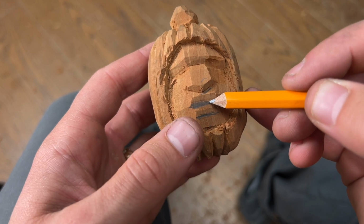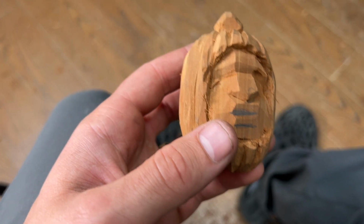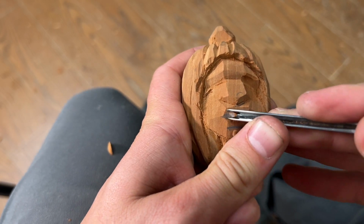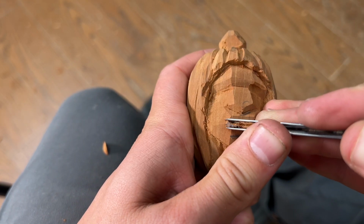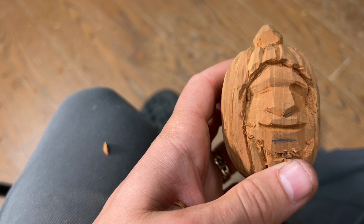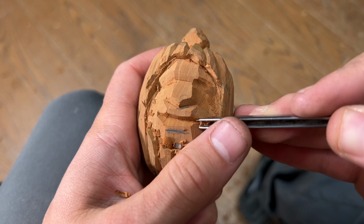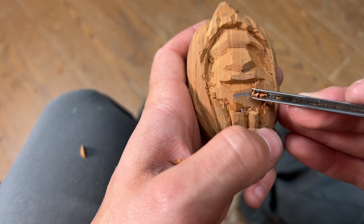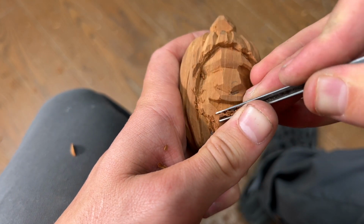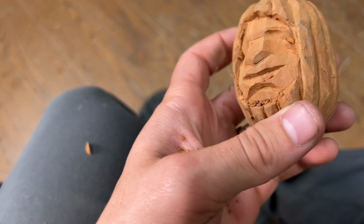And in this first line, this dividing line between the first and second third, I'm gonna carve a V groove to open the mouth. That's gonna be the opening of the mouth. Okay, so it starts out fairly straight, and then we're gonna widen it out just like that, all right? And I'm gonna take the lower lip back just a little bit. And then this bottom third, I'm actually gonna carve a kind of upside down U shape to carve in or establish the chin, just like that.